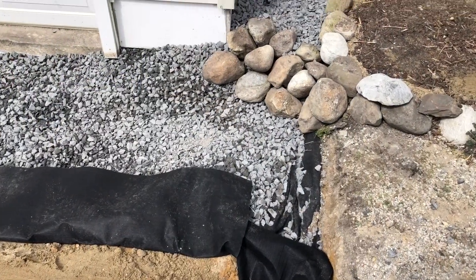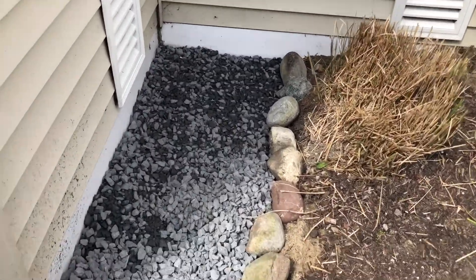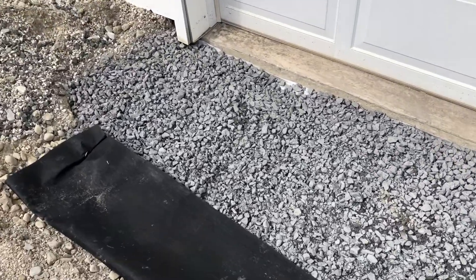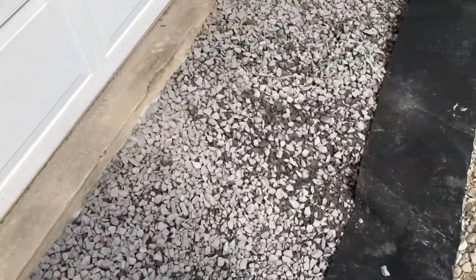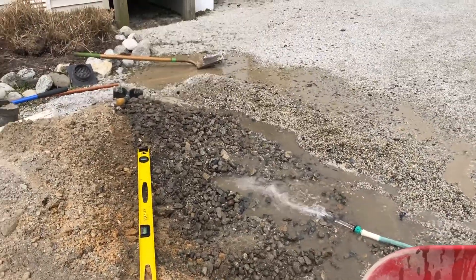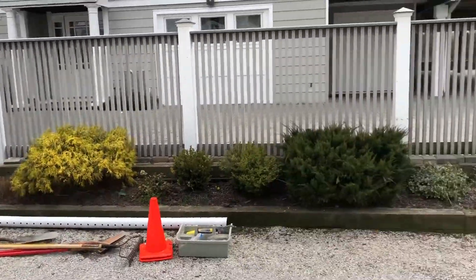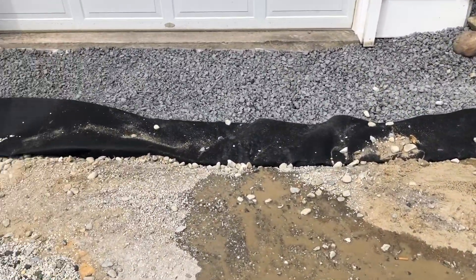Next will be to rock, and you have to do everything by hand. Now that we have it backfilled, we've gone ahead and put some of the water features back around plus created a new one. All of this is now French drain with plastic to the left, filter cloth to the right, all the way around — we folded it in. We're going to try to use some of the rock that was in here after we sift through and clean it up, so it'll look like we were never here. You can see the whole reason they even need this French drain in front of the garage — all the water is rushing down here from this entire property since it's graded out that way, washing all the way to the garage. Now that water will actually have somewhere to go.